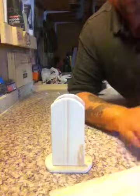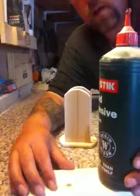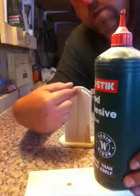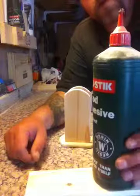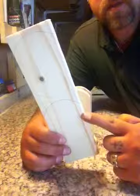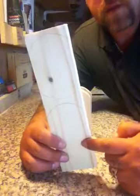All you need to do, basically get yourself a scrap piece of wood like this, measure 5 inches up, and use your curved template to get the curve on this piece of wood here. Just draw your pencil line, and use your coping saw, and cut it out. It's as simple as that. So that's 5 inches high, and you'll need 2 of those.